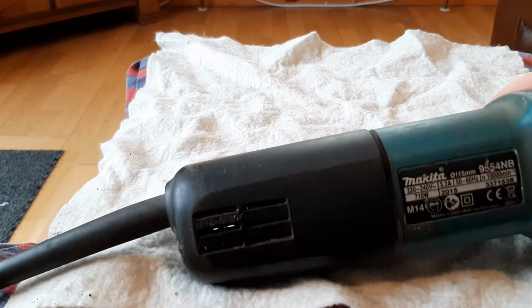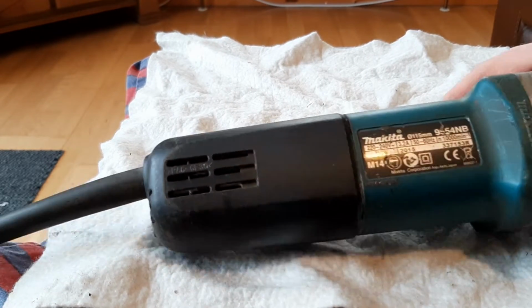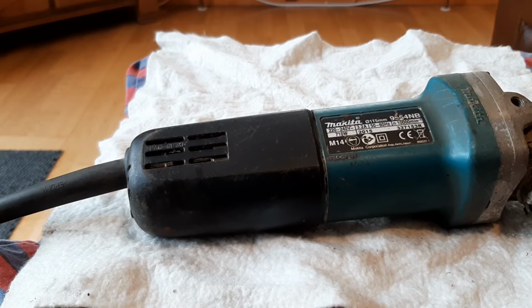Most of the things I work on are cordless battery machines. I've worked in a couple of these before, so I know they can be worth repairing. The issue with this particular one, it's running slow with plumes of smoke exiting from the front of it. Without opening, I know it needs armature and brushes.